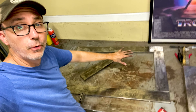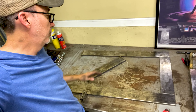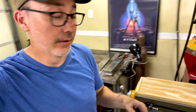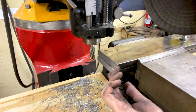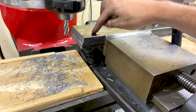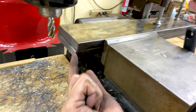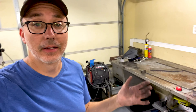The dolly calls for four cross pieces, and I want to make sure they're exactly the same so that it's perfectly square. Because I'm a little bit anal and because I am a machinist, I decided to take the legs and even them up. Here's the shortest one, and I'm just taking an end mill and making sure they're all exactly the same size. That should make getting it square a little bit easier. I love that I can be super precise even in a welding project.